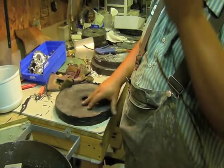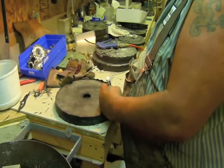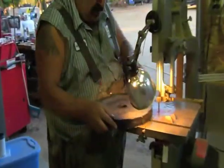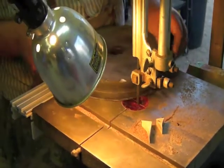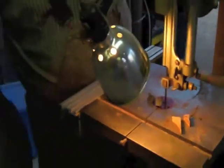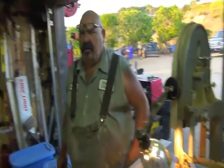You don't ever want to cut your registration where you have an object because you just destroyed your mold. The metal will just go flying right out, gone. The whole mold's junk. And that's the registration mark, and you look at that now, it's so easy when you put it together, you know where it's at. We're going to mark this mold.